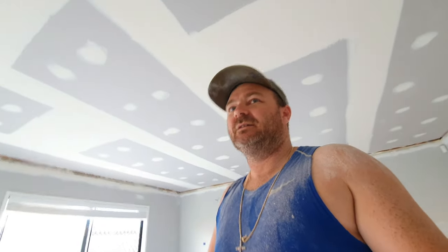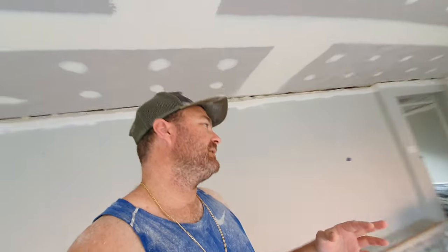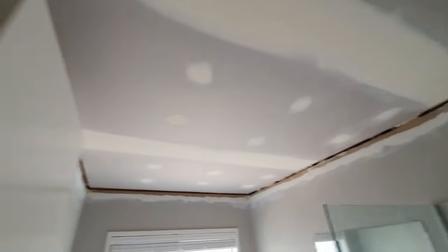It's made from the same material as the drywall itself — paper face gypsum. And it doesn't need to be sealed for any fire regulation here, we don't have that. Yesterday we got it all set. I'll probably show you a little bit of the setting process — we used cornice cement through the box and through the taper. It was a little bit rough but we got it done in the end, so I'll just show you around. Most of it is sanded as well.